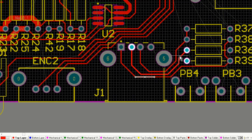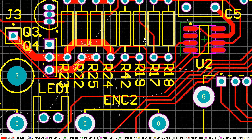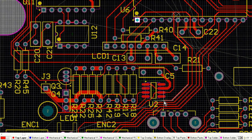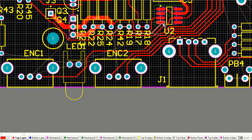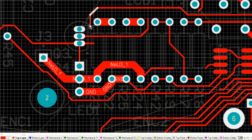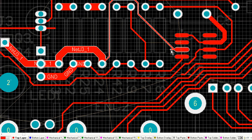What am I doing there? I'm changing the USB layouts there. You saw a slight shuffle there in like four traces. I just pushed them all down, and there we go. I managed to fit in another trace, or not quite. I ran out of room there, right in the center. So there you go, I decided to take that around the top instead.